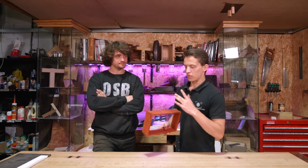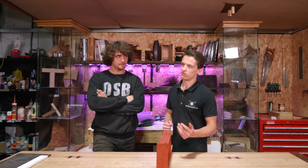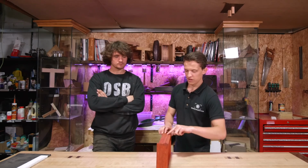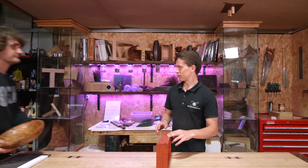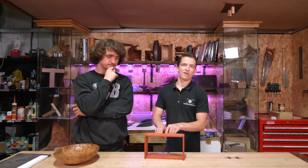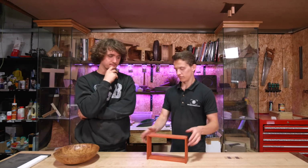But then my biggest problem, as you saw in the video, was the long edge. Some of it was not enough force on the top of the plane as I'm going through. But the other part was that I was trying to plane the middle section because I'd roughed it up quite badly. But what I'd ended up doing is, because the two ends were taller than the middle, I could never get to that middle bit, so I kept on extending the blade until I dug into it and then tore out, and it just kept on getting worse. But I didn't realise that these ends were taller than the middle bit, and you made me understand that.